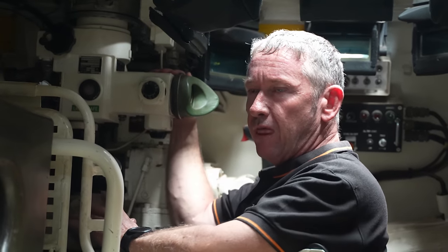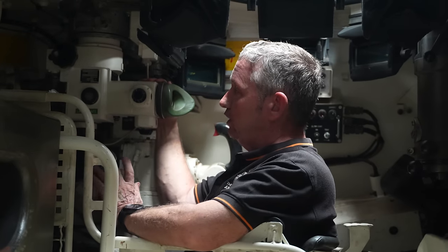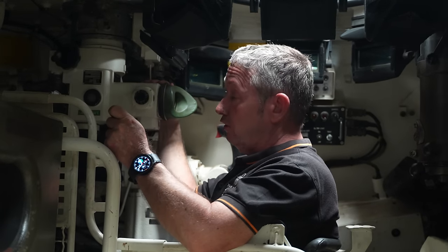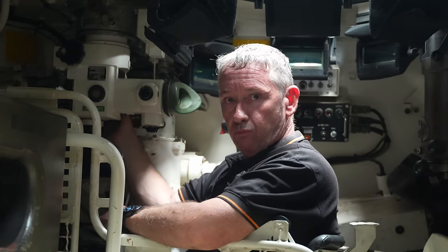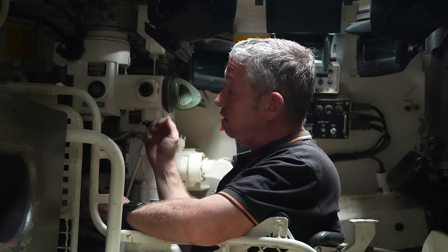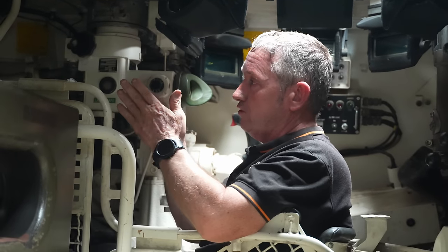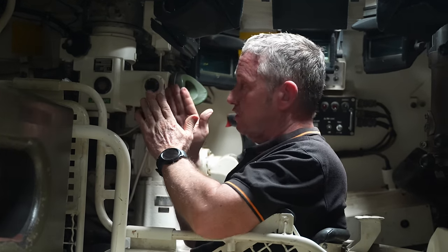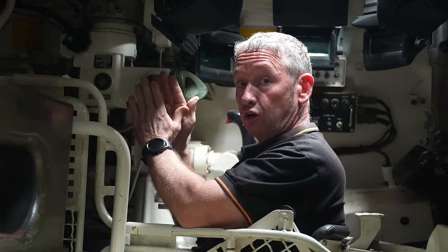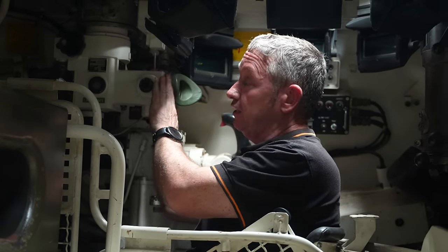It also has what I would call a very basic hunter-killer role. Essentially I can turn the sight 360 degrees. If I unlock my detent switch I can traverse around to, say, 3 o'clock. If I identify a target I can then lock my detent switch in, and once the gunner traverses right and my sight and the gunner's sight are locked in, the sight will actually lock. So now what the gunner's looking at is what I'm looking at.